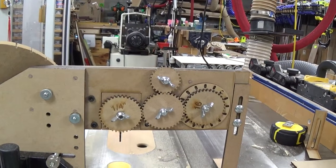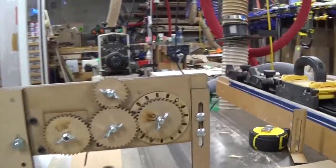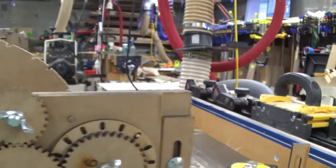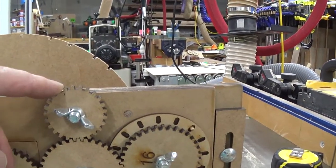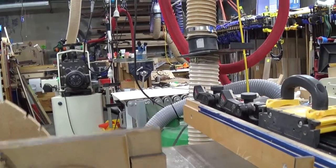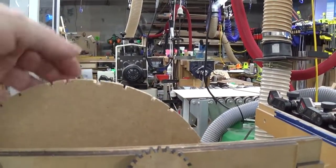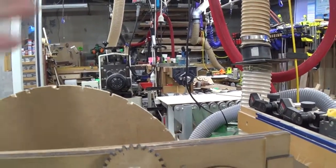Back again for another take. I just suddenly realized I made one big fatal mistake as well. The whole jig is designed so that you control the rotation with that little gear there, and you keep pressure on it to keep it in the same direction. The mistake I made is that because this big wheel is there, I tended to turn the wheel itself directly, and sometimes when you do that you actually move it along the spindle and get it out of alignment.